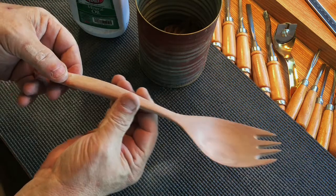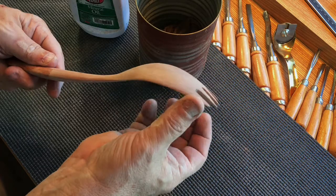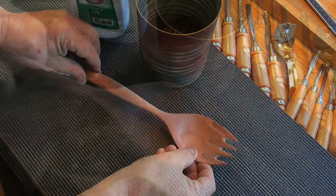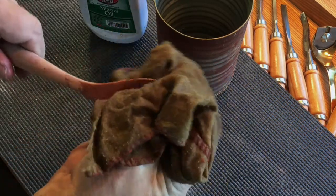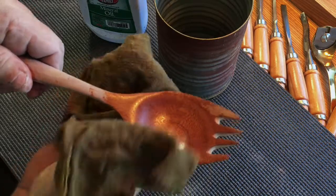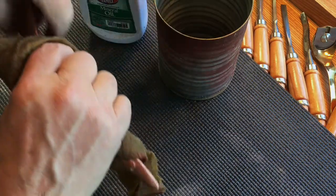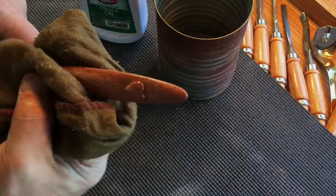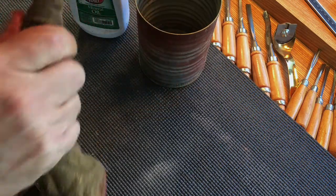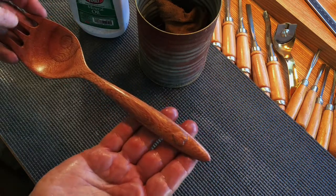This spork is ready to be oiled, and again that's the fun part where we apply mineral oil and watch the grain come out. I'm generous with my application of the oil, especially in this first coat. I work it around to saturate the wood thoroughly and to get into all the tiny nooks and crannies. As the oil fills the pores on the surface of the wood, it shows you exactly how smooth you've refined your surface when you went all the way down to the 600 grit abrasive.